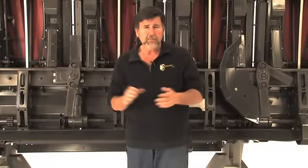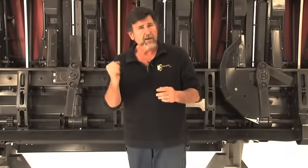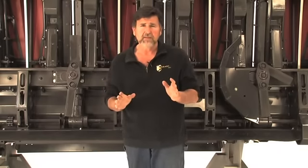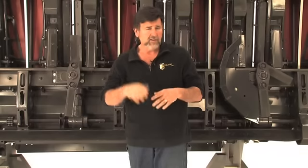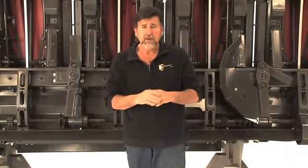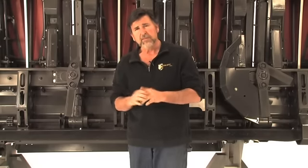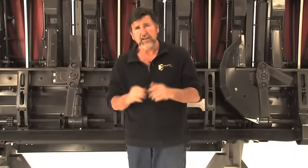With the Drago chopper, the taller the corn stalks, the bigger the stalks, the better it chops. But sometimes the toughest stalk to chop is not the biggest. It's sometimes a smaller plant that's been through some stress. It can get leathery, ropey, hard to chop. Here are some extra options we can add to the chopper to overcome some of those factors and to improve the chopping quality to meet your needs.